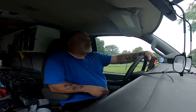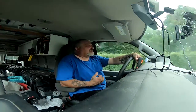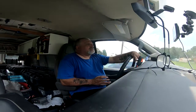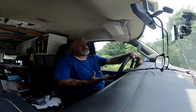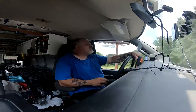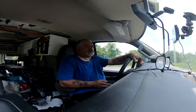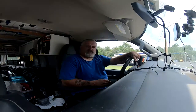The paint I used today was Paint Shield by Sherwin-Williams. It seemed like a very watery paint — it was all mixed when I got to the job site and it was very watery. It did not work well at all with a small roller. My suggestion is if you're going to use Paint Shield, use a 3/8-inch nap or even a half-inch — something that's going to absorb it — and don't have a very wet roller or it's going to run all over the place. As far as coverage goes, it probably should have two coats. His bathroom was the same color and he did not want to pay for a second coat, and he wanted me in and out as quick as I could. It looks great, but if it were a different color underneath I think it would probably be showing through.